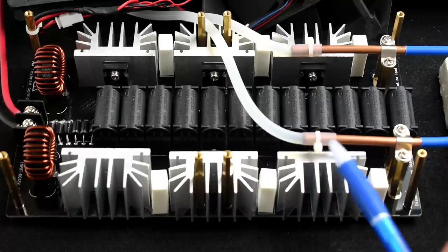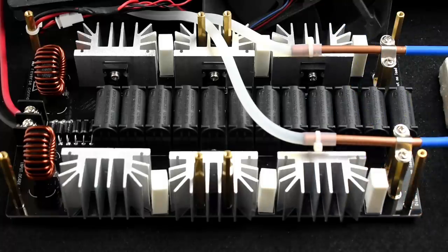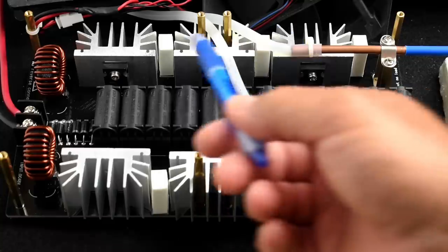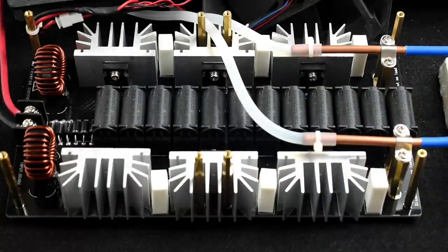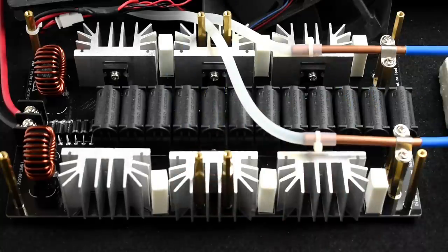The tubing was slid over the ends of the copper pipe and I clamped it just to make sure it does not slide off. The last thing you want to see is water pouring all over that board. Each one of these large heat sinks has a MOSFET bolted onto it. And the MOSFET is an IRFP260N. Each one of these resistors is on the gate to those MOSFETs, and it's a 5 watt 470 ohm